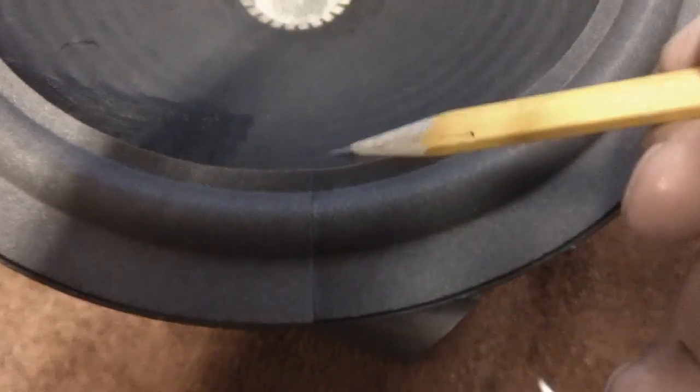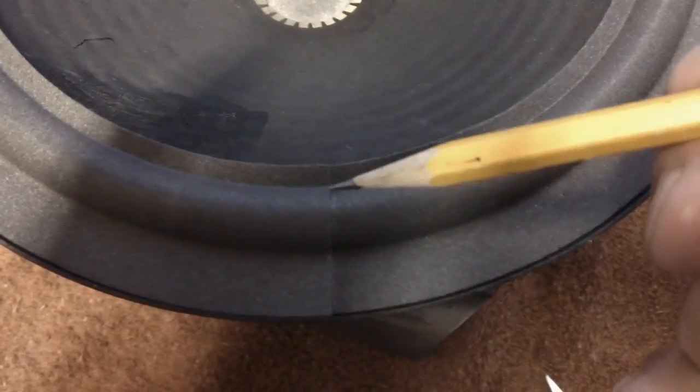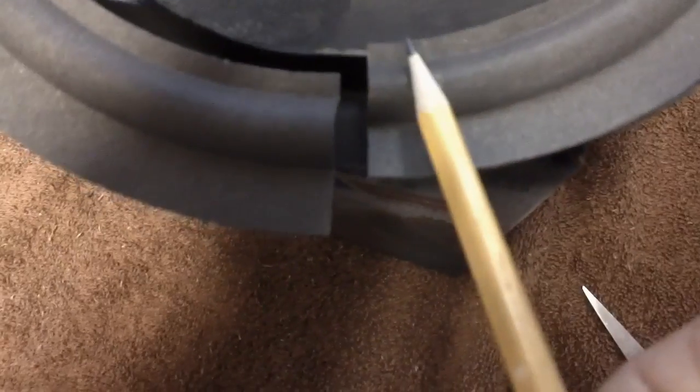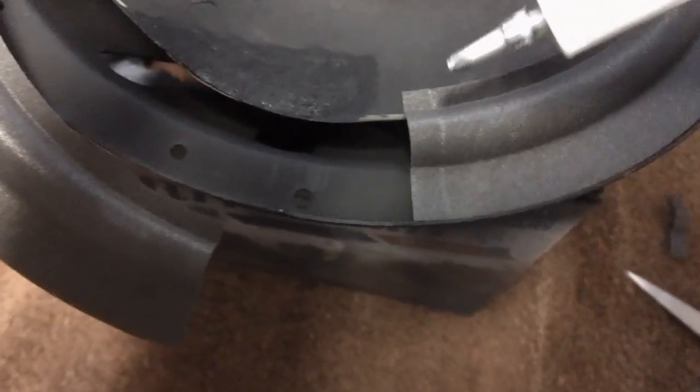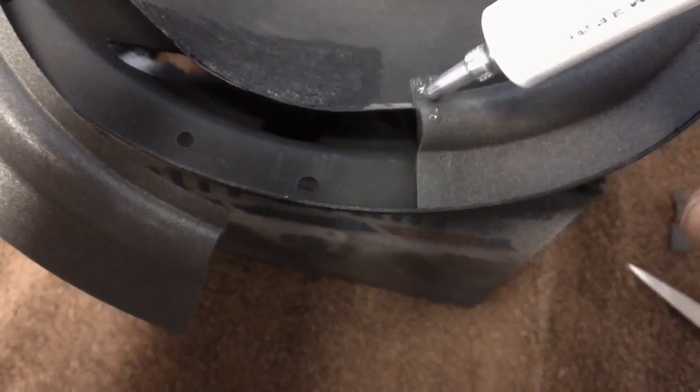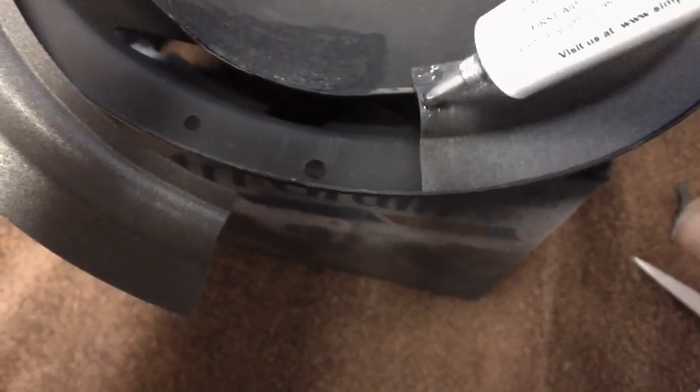She's been cut and I overlapped it and took this pencil and marked the foam. Now if it turns out that it's a quarter inch or less of an overlap, I can just go ahead and glue it. If not, I'll have to trim it a little bit more to get it no more than a quarter of an inch overlap. Oh yeah, that is quite a bit - I'm going to have to cut it down further and then do my overlap. All right, that looks good. This is really good glue, by the way - it's especially designed for foam surrounds, and I've used it before. It really is good.